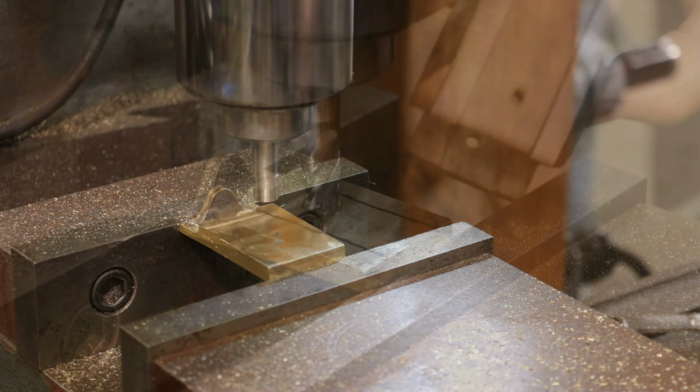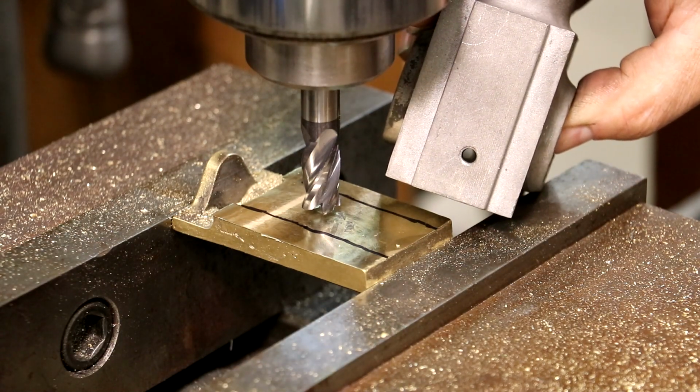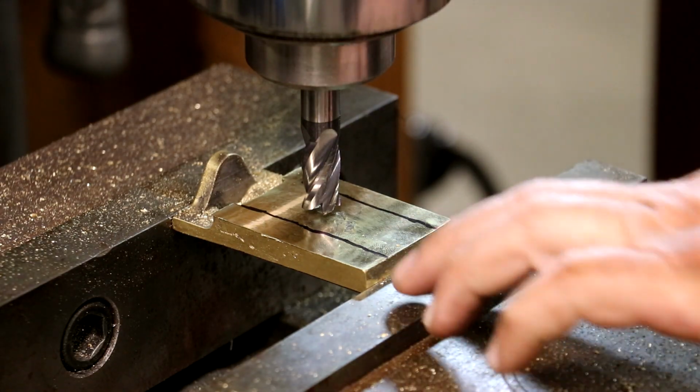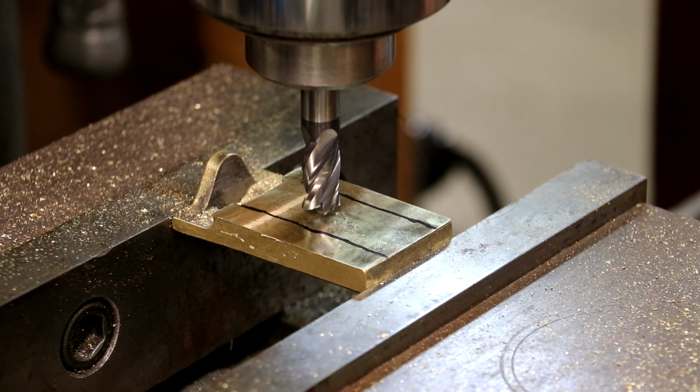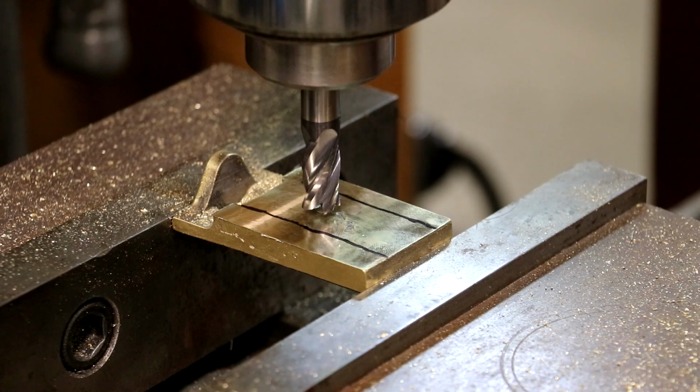All right, again, there's the crosshead that we are going to be making a slot for. So this needs to be down. It's 1 inch wide, and I think I said 200 thousandths deep, but it's 150 thousandths deep is how deep that trough needs to go. I just took a Sharpie and put some rough marks on there. That is not a precision mark by any means, but it just helps me make sure while I'm doing this that I'm not about to screw something up.